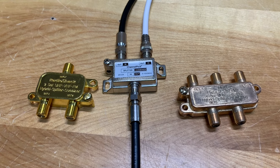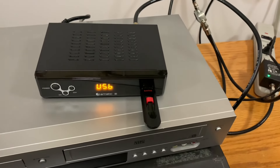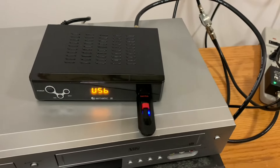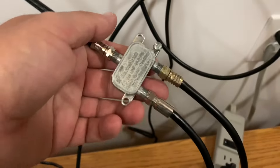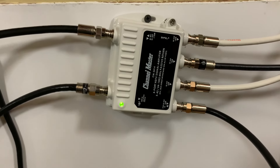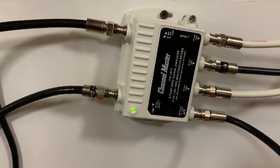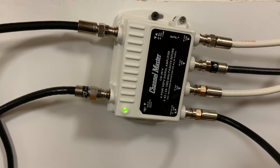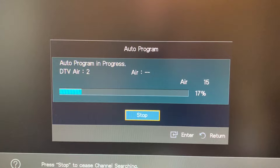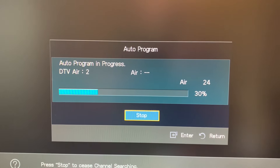Check out the description of this video to see more on this topic, including videos I've made about my own home cable system using some really cool modulators. I just took this digital converter box with my USB drive that has my own videos on it and spliced it into my cable system using one of these diplexers — this goes up to the distribution amplifier. Now all I have to do is run a channel scan on all the TVs in my house, and that private channel will get scanned in. It will come up as an analog air channel, while the other channels are all DTV or digital TV channels from the TV antenna.